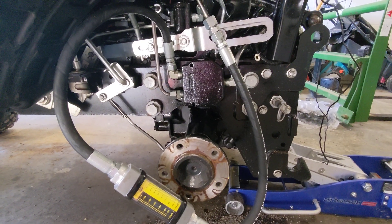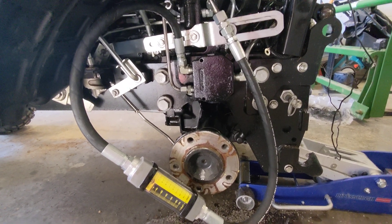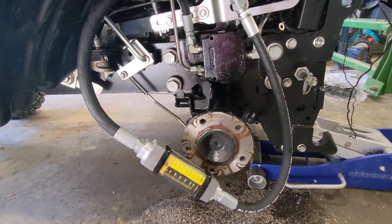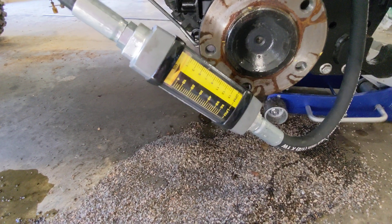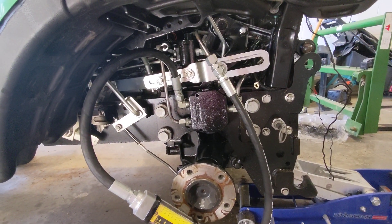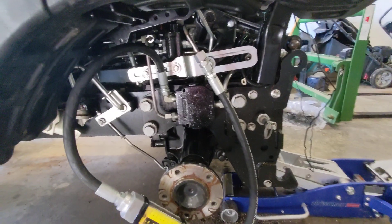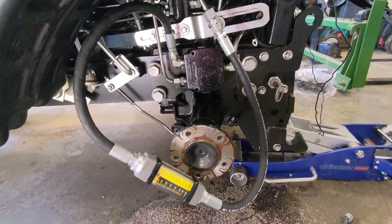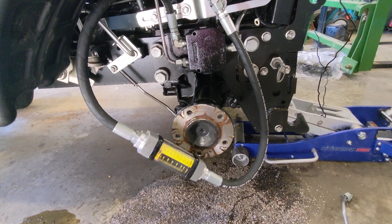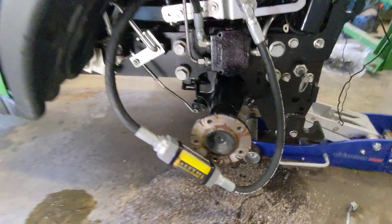I'll show you what I've got going on. I've done a video for some temperature tests and flow meter tests, but one of the most interesting things for me is to understand exactly how much flow we were getting through the priority valve that goes to the steering. You can see I've got my flow meter here. On the flow divider I've hooked this into the steering circuit and back in, so I'm going to start it up and show you the difference between basically no flow and up to about two gallons per minute.